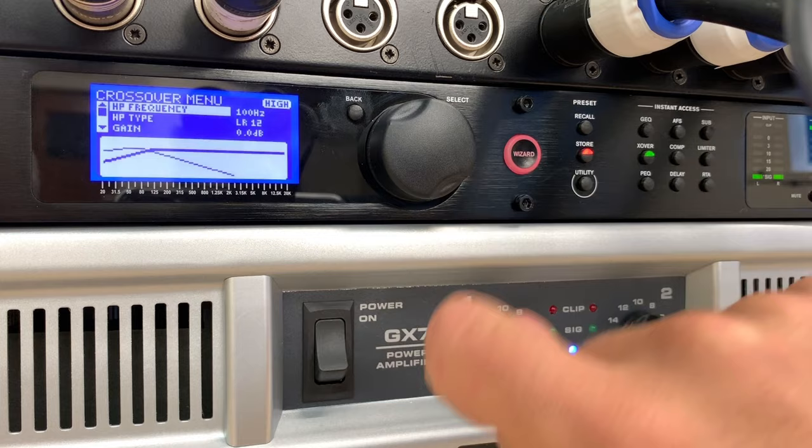Going to this frequency — 778 Hz — let's scroll that up to about 3.5 kHz. Bringing in the pink noise and applying the EQ, I'm going to show you how I cut it. Turning it down — you can hear I'm completely changing the tone of the mid-high speakers by taking all that top end out. It sounds ridiculous, but it's purely a demonstration. There's also a Q setting where you can alter the width of the curve to be more precise with your frequencies. All of this is for you to optimize the sound of your speakers.